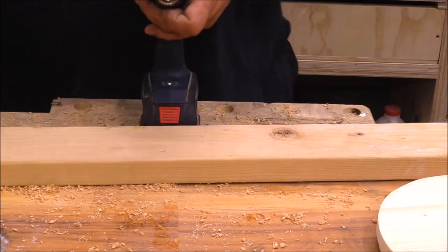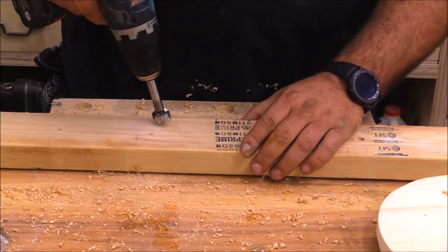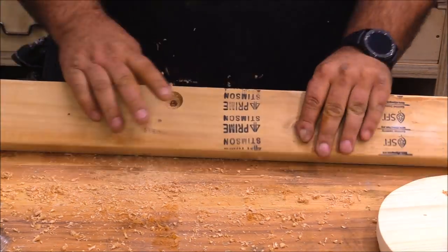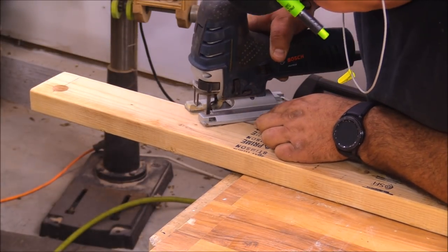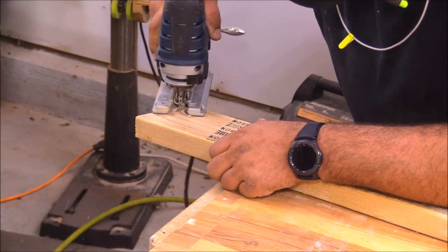The next step is to connect the two pieces and I'm going to do that with a piece of 2x4. I started by drilling a really small hole all the way through, and then used a Forstner bit to drill two holes from each end without penetrating all the way through the material. Then I used a 3/8 bit to drill out a hole in the center — this will restrict the flow of sand.